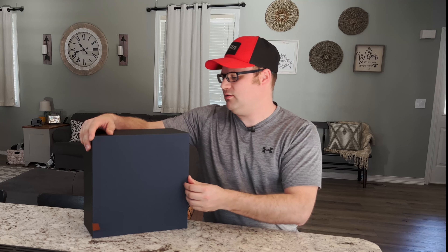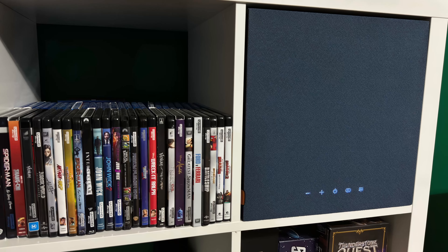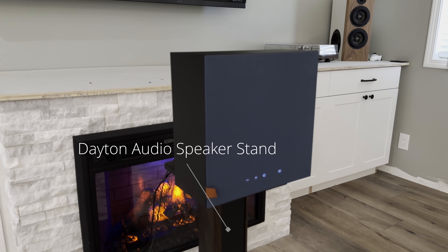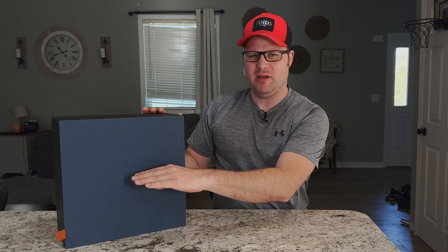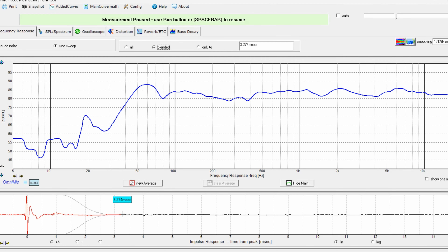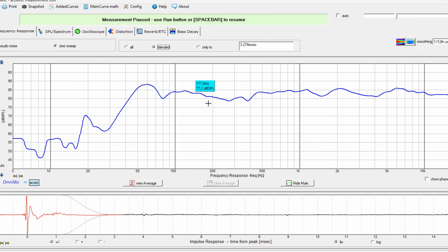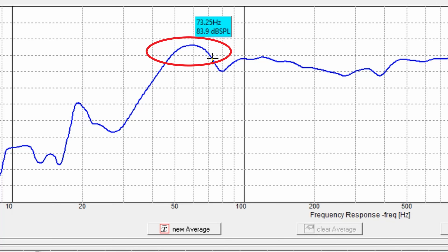Let's put back on that grill and do some testing. Once we found the acoustic center of everything, which appears to be about midway on the speaker, everything really opened up. Everything was about plus or minus two and a half decibels, which is what you'd want to see on a high-end speaker and something you definitely don't expect from a Bluetooth speaker, even if it has Morel's name on it. So I was actually really impressed with the frequency response. There were some areas that were interesting, like the dip between around 200 and 400 Hz, but it is a relatively small dip.